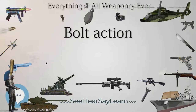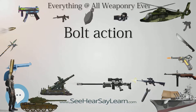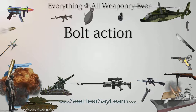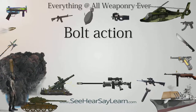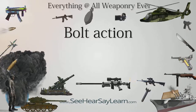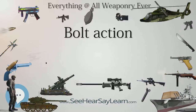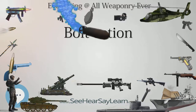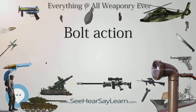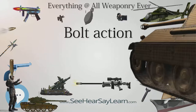Other designs: The Vetterli rifle was the first bolt action repeating rifle introduced by an army, used by the Swiss Army from 1869 to circa 1890. Modified Vetterlis were also used by the Italian Army. Another notable design is the Norwegian Krag-Jørgensen, which was used by Norway, Denmark, and briefly the United States. It is unusual among bolt action rifles in that it is loaded through a gate on the right side of the receiver, and thus can be reloaded without opening the bolt. The Norwegian and Danish versions have two locking lugs, while the American version has only one, and in all versions the bolt handle itself serves as an emergency locking lug. The Krag's major disadvantage is that it is usually loaded by hand one round at a time, making it slower to reload than other designs which used stripper or en-bloc clips.